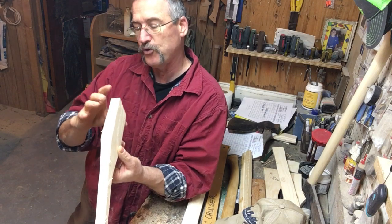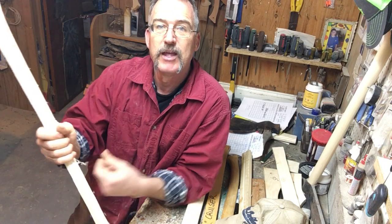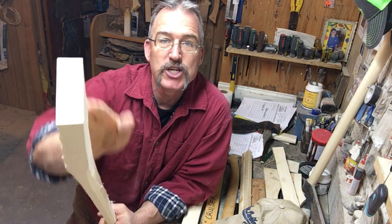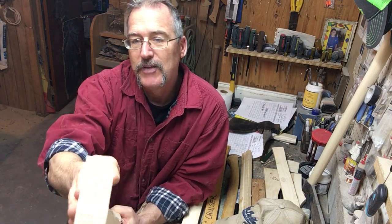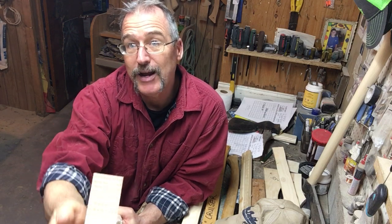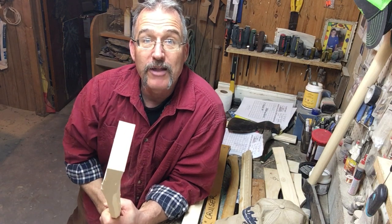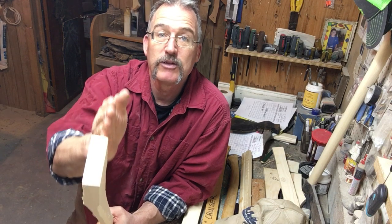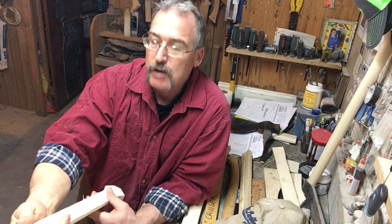So I've left him a full 3-inch at the top. It's totally rectangular here at the top, so he can make those cuts in it where he needs. It's going to be D-shaped, either D-shaped this way or D-shaped this way. Given that the handle is offset left, likely the D is on the right hand side, but I'm not 100% sure. So why would I bother cutting it in there and ruin the handle for the guy? I'm going to leave it like that, and also without the kerf in it for him, and he can put that in when he gets it.